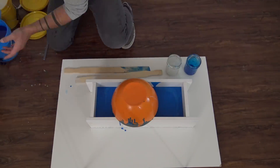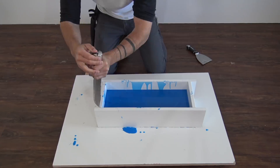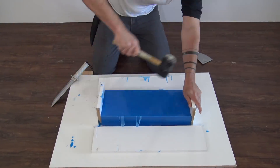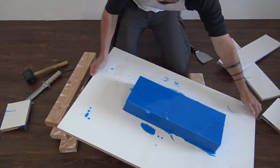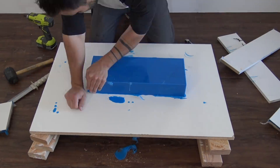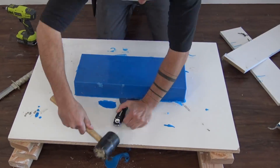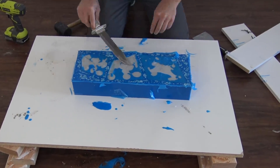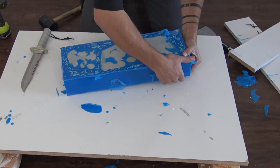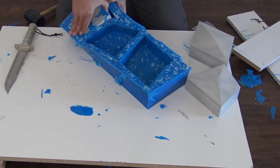It's a two part mix and the white part, which is the activator, had really settled and become kind of chalky and never thoroughly mixed into the blue. After letting the silicone cure 24 hours I removed the melamine and pulled out the silicone. Most of the mold was nice and rubbery but there were little white flakes in it that didn't fully harden, and I wasn't sure if this was going to work well for casting concrete.